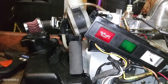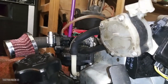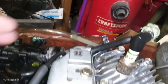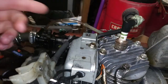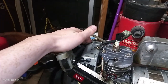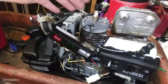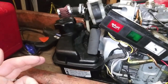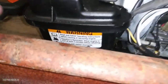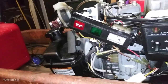I said 'forget that' - I've got this little fuel pump, it's a diaphragm vacuum-based fuel pump that runs into the intake manifold. As long as the carburetor isn't wide open - and I'll explain why this carburetor can't be wide open - it will be able to create enough vacuum to push on the diaphragm which allows fuel to be delivered. The original fuel tank looked like it had been cracked, so I just put a little Briggs and Stratton small lawnmower engine fuel tank on the side.